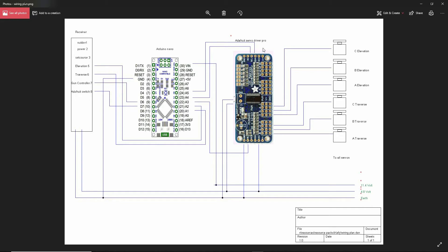Out of that, I run all of the seven servos from these nice little ports here which I can plug straight into. I'm running it on 11.4 volts from a LiPo, and that's putting power into the nano. I'm also reducing the power down to 4.8 volts, and that powers everything completely through. It's an external power process because you simply don't drive all of this from the Arduino.